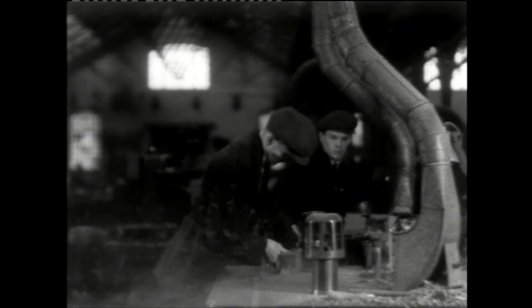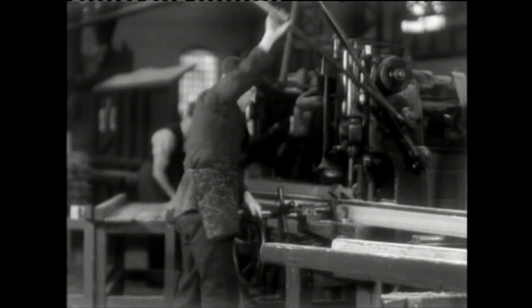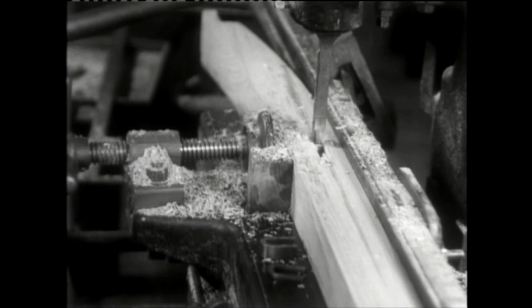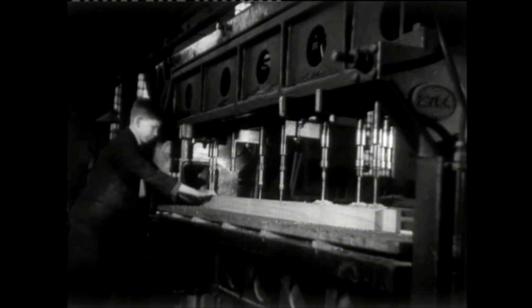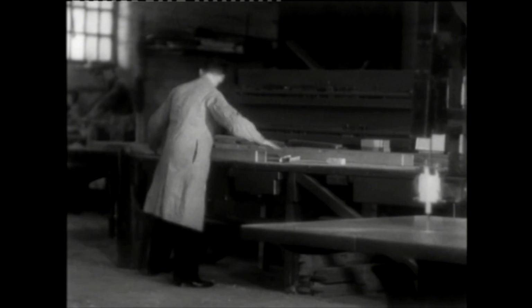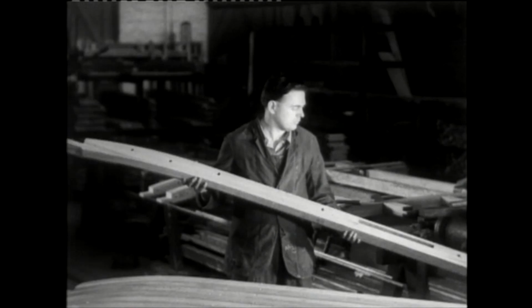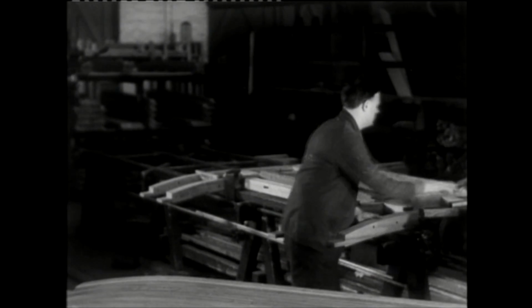Watch your fingers! The joints are then added, followed by the mortises into which the horizontal frame members will be fitted. All the required holes are drilled at once in the vertical member, after which it is transferred to a finishing bench for a final inspection and sand. The stack of completed verticals are then transferred to the assembly bench, where the carriage side is constructed in sections for eventual assembly.